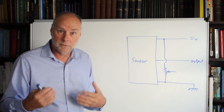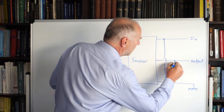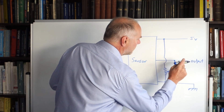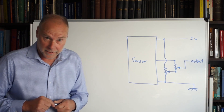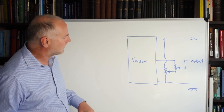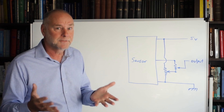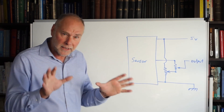That's our reference voltage. We put the other pot there, like that, and then we get rid of that output and connect it to our new wiper. This first pot simply gives us a 2.5 volt output on the wiper — we adjust the pot until we have 2.5 volts measured between the output and ground with our multimeter, and then we leave it.